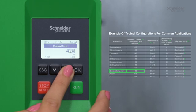Status LEDs and Troubleshooting. At any time, LEDs can be checked in order to know the status of the soft starter. For more information, refer to the user manual. In case of troubleshooting, scan the QR code in front of the soft starter to get warning and error codes explanations in the diagnostics section. For example, if you have an overcurrent error, by clicking on the corresponding error, you can get the probable cause and how to fix it. For more information, download the ATS 430 user manual on se.com.